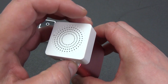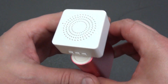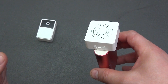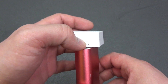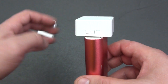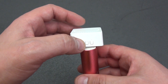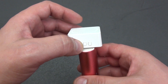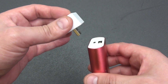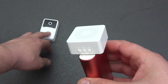To pair: connect power to the speaker, then hold the gear button until the indication LED inside the case lights up blue. After this, press the intercom call button — the LED in the speaker will blink three times, confirming the intercom and speaker are paired. Now when someone presses the intercom button, you will immediately hear the ringtone from the speaker. You can adjust the speaker volume using the middle button — there are four volume levels: loudest, medium, quiet, and silent. There are also many different ringtone melodies available, ranging from a simple ding-dong to well-known songs. Note that when the speaker loses power, the melody and volume reset to defaults, but the pairing with the main intercom is retained.